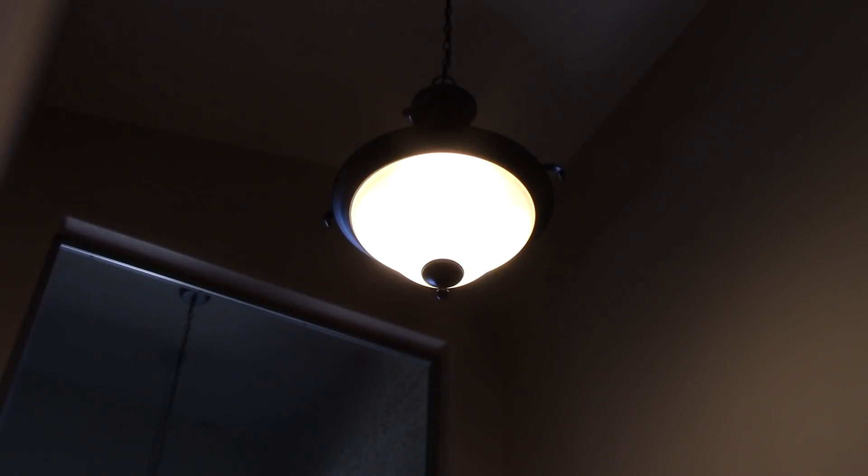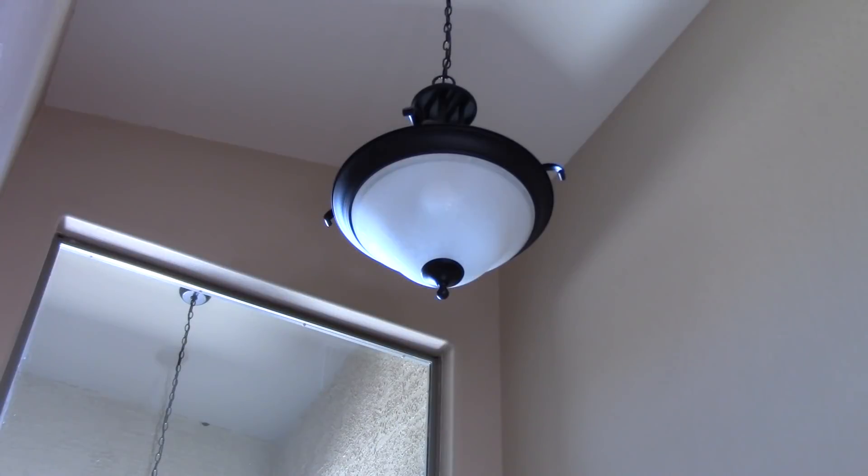Here's a shot of the light fixture I'll be controlling — it's right in the main foyer of my entrance area. First we need to go shut off the breaker so we can open up this switch box and get started with our installation. Coming back, I see that my panel was labeled correctly: front entryway lights and receptacles. I shut off that breaker and sure enough, the light is out. We're good to go.